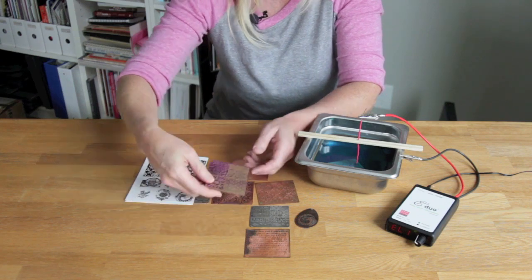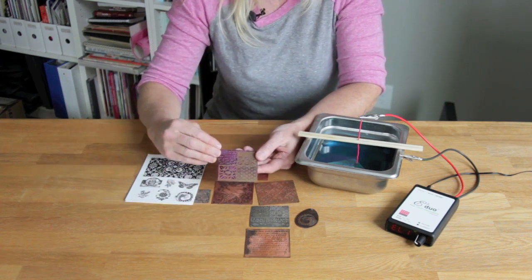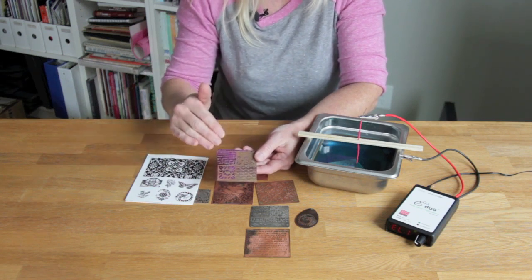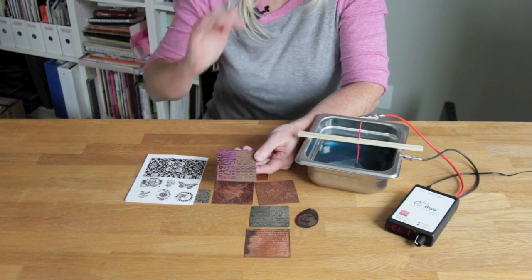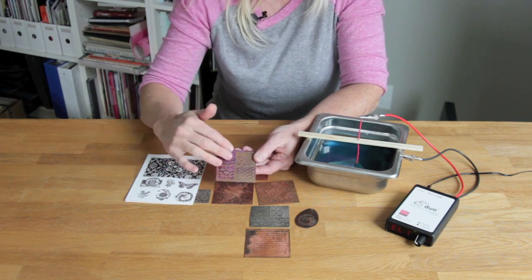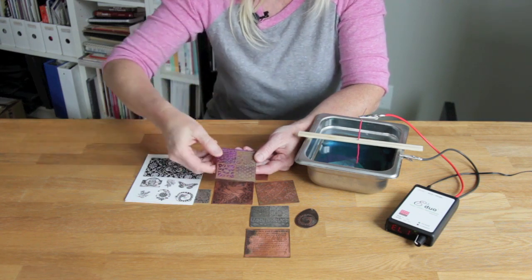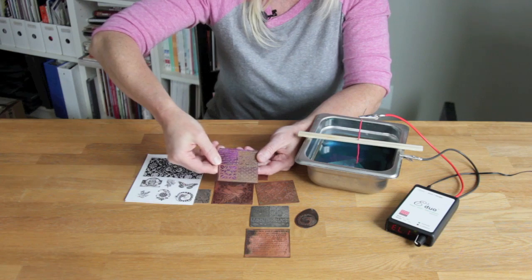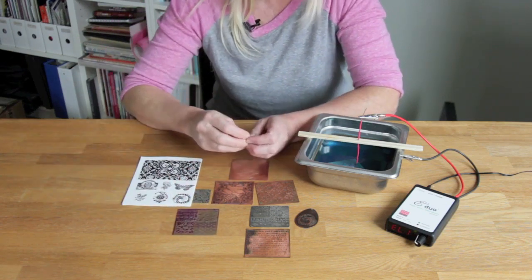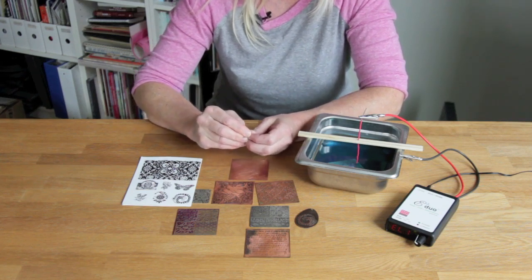You can also use UV film, which we really like. UV film gives you a lot of control and precision for really fine lines. It stays on very well without flaking off during the etching process and won't come off until you remove it, so you can achieve deep etching with that resist. There's more information on our site about how to use it. You can also use an oil-based paint pen, stickers, or nail polish as a resist — those work great too.